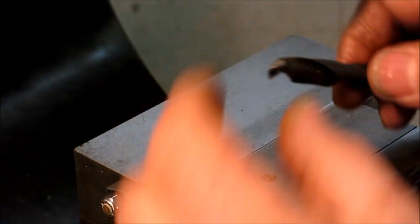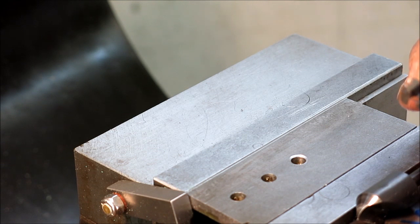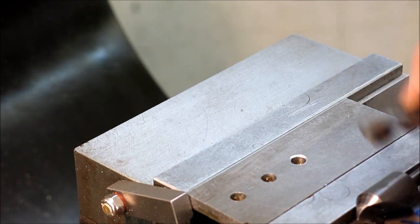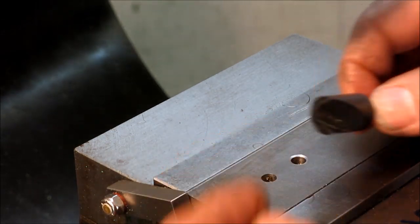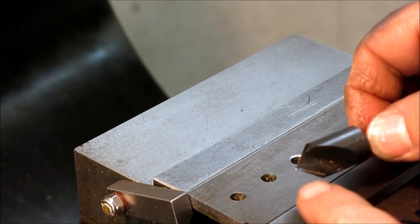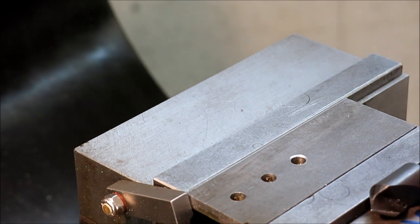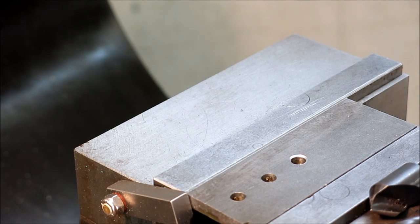And then drills are easy to touch up, even for beginners, okay? So that's the thing that I wanted to talk about, too. Yeah, you can use standard countersinks, and they're real nice, and they don't chatter, which is the claim to fame for these single flute guys. They don't chatter as much as drills do when doing those kinds of operations. But you can also use drills as countersinks too.